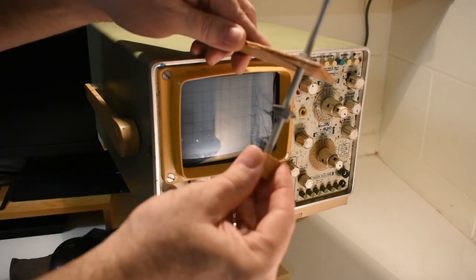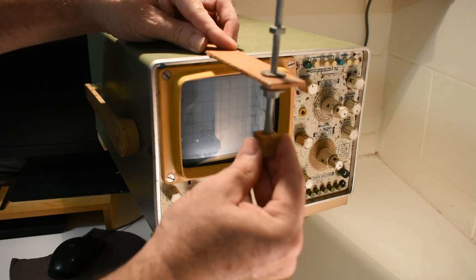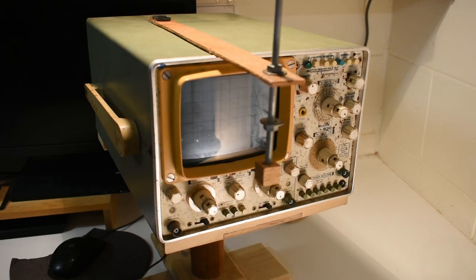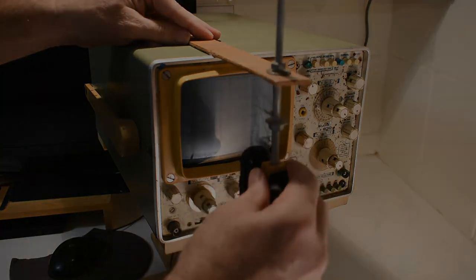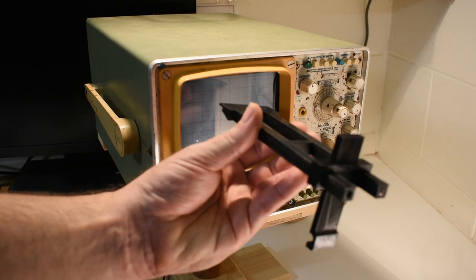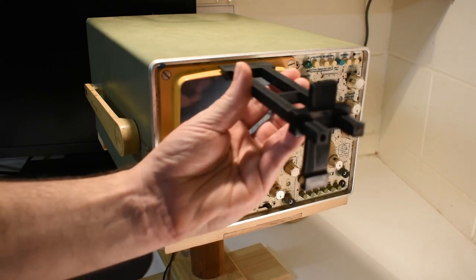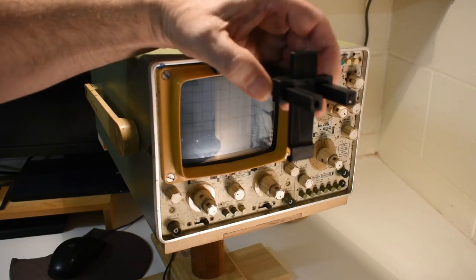This could be as simple as using a piece of plywood with threaded rod to give an adjustable mount, or even with cardboard hot gluing something together. However, since I have a 3D printer, I made a custom mount that provides an easily adjustable 3 degrees of freedom, specifically to fit my scope's CRT and style of webcam.